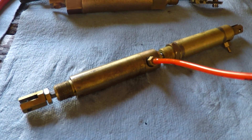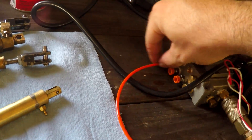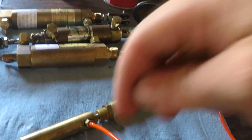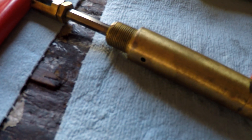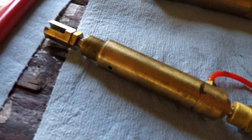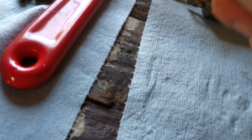Now I'm going to test the eye turn cylinders, which are totally different from all the other cylinders because they're single-acting with spring return — so you plug up one of the ports and just have one hose go to supply air and return air. I hooked up the first one and it's bad. Right here is a little exhaust port so air can escape going in and out, and it's just flooding out of that exhaust port, which means the seal in there is bad. It is actuating, but as you can see it's not going as far as it can go.